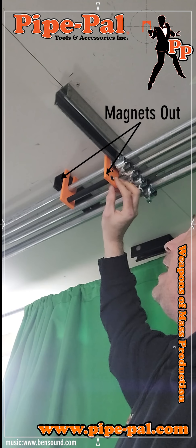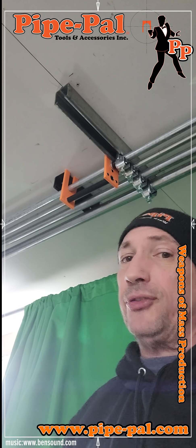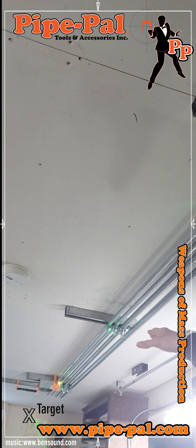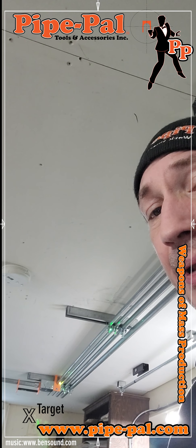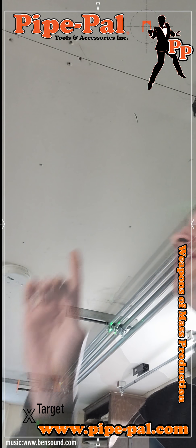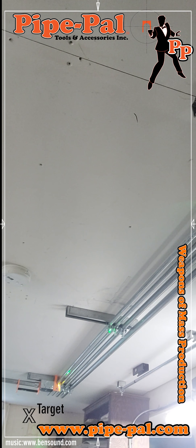The magnets are out, and they give you the ability to move it ever so slightly. I've got a conduit spacer down on the end unit there, just so I can mark out for my center. You can get a very good idea as to where your laser is. Get your mark on the other end, center your conduit on where the anchor is. As I move it around, you can see that pretty quickly I'm just about on the center of that conduit.